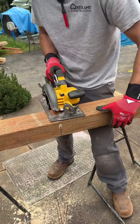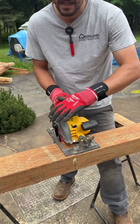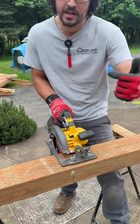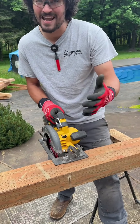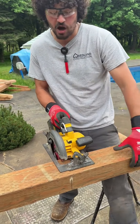Now here is the real key part. Since I didn't even make a line on the back side, what I like to do is as you're cutting you can feel the saw wants to follow the lower line, because most of the blade is in that lower line, or at least half the blade is in the lower line. So rather than trying to follow a line that inevitably isn't gonna line up perfectly with the line on the other side, I just let the saw do the work.